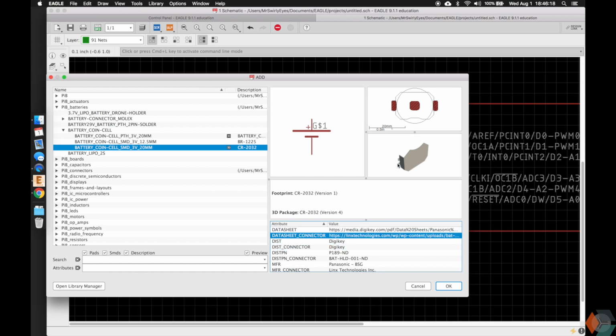And the connector for it, which is this 3D model, it'll have this connector. It's a surface mount connector, as denoted here. It has pads. This is for the negative polarity where the battery will connect to, and then the positive connects to the chassis, which connects to these 2 pins. This is the symbol for it, and again the 3D model.